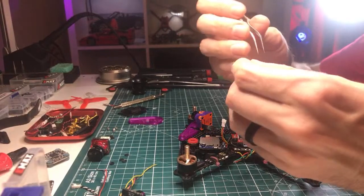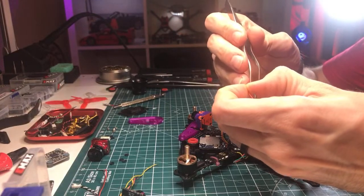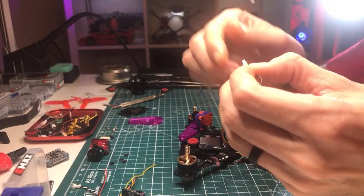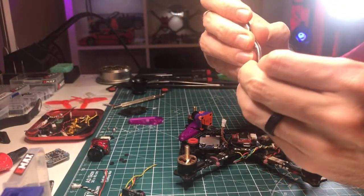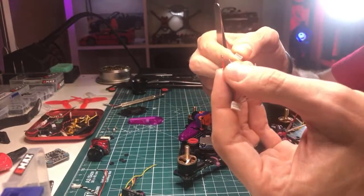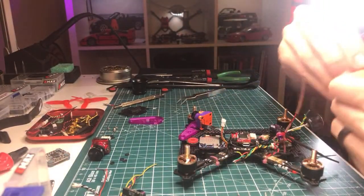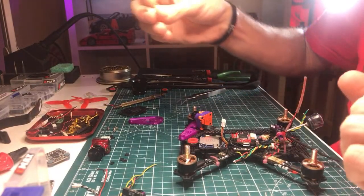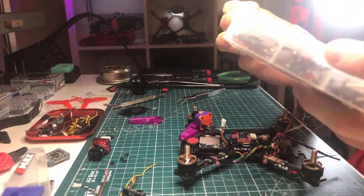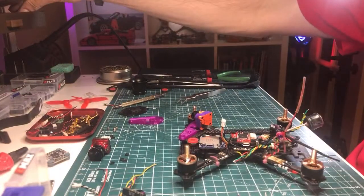So this last one is being a real dick. You guys hadn't noticed. I think I might have just gotten it. Nope. So when they're being a dick, push the wire in, because it's like a little hook that grabs onto the plastic, and that's exactly what was happening. I pushed the wire in, now we're fine, although I also bent that tab back a little too far. It's a tiny little hook that grabs on the plastic, and if you're pulling on the wires, it makes it harder to lift the plastic bastards up. So I want to save this, and I want to put it in a super secret special spot so it doesn't get confused with all the other ones. Is that this? Yeah, that's this. This is my weirdo spot for those little Molex connectors or whatever the hell it is.